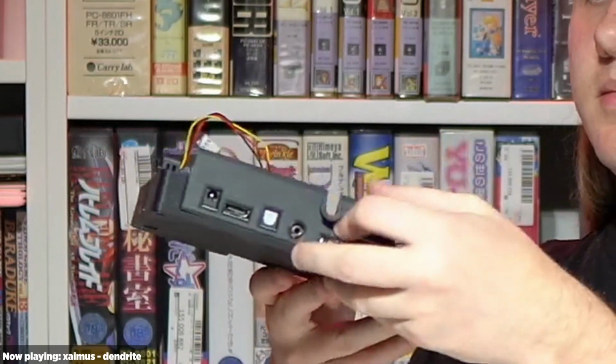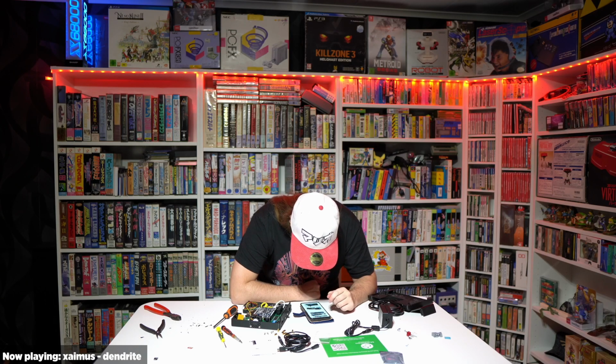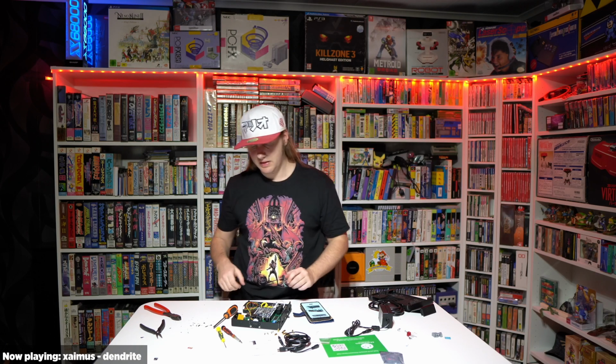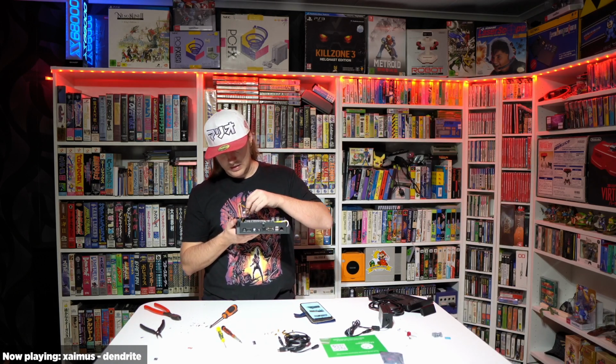Very nice. Now we can connect the fan to either J7 or J8. This is a 5 volt fan, but it can run slower and quieter on the 3.3 volt connection, unless you live in a very hot country. Well, I live in a pretty cold country for the most part, so I'm gonna use the 3 volt instead.